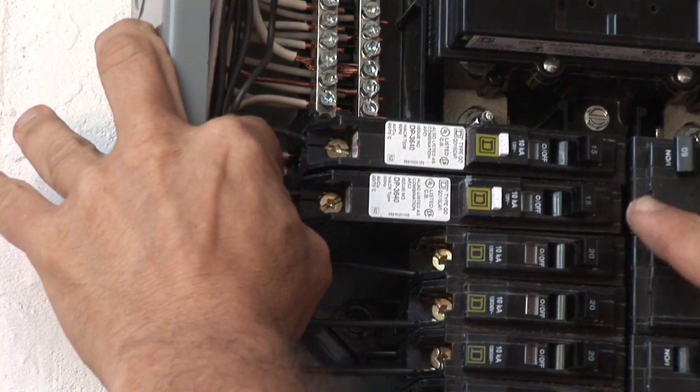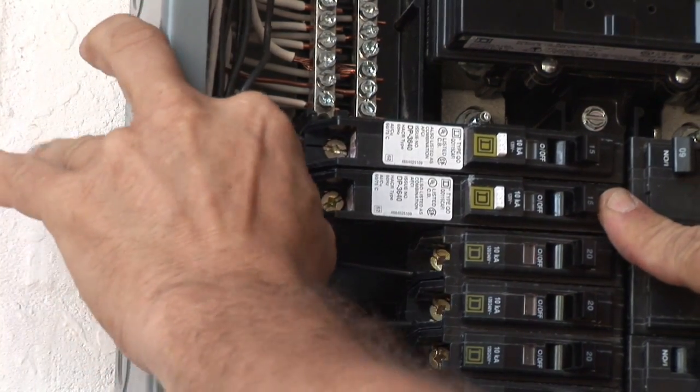So what we will do after that — make sure everything is all tight — is check the breakers. This is how we check the breaker wiring: we give each wire a little tug to make sure the wires don't fall out of the breaker.